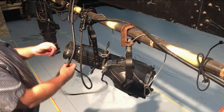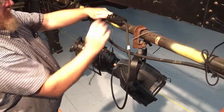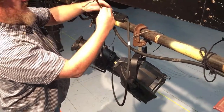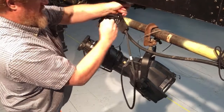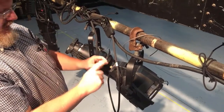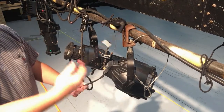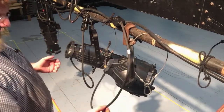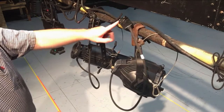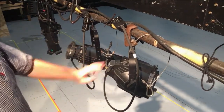Then grab the tie line and tie the cable up to the pipe. Notice I'm tying it on the upstream side of the connector — the reason is that once it's tied, if a bulb burns out I can come here, take the cap off, and unplug it without having to untie the tie line. Got a nice little bow knot there. We've got some focus tail so that if we need to move the fixture around we don't have to reconfigure all the circuiting. And make sure this circuit information gets noted on the plot so we know what fixture this is and where it goes.